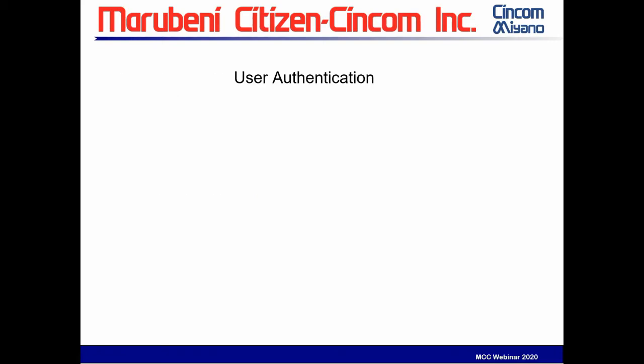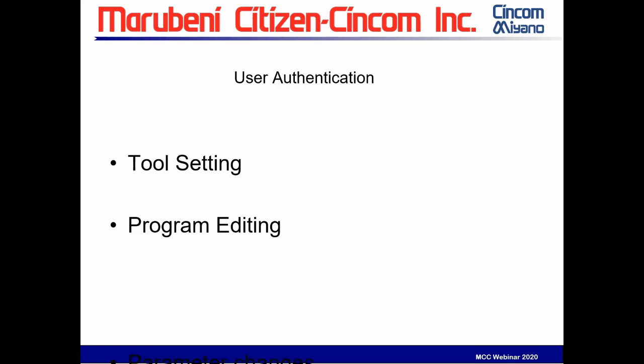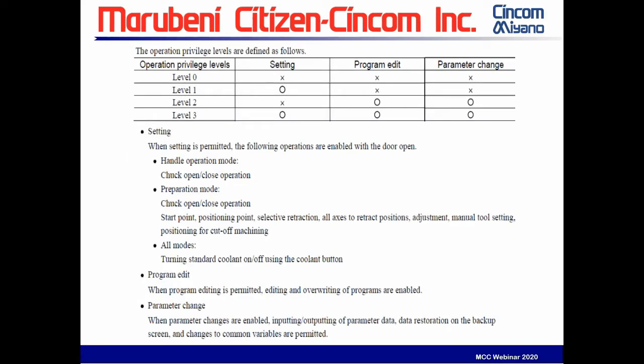Something else we've added to this is user authorization or user authentication. You can control who can set tools, who can edit programs, and who makes parameter changes. There's four levels. There's a zero level, which basically, if somebody has zero level privileges, all they can do is press the start button and possibly make an offset, but they can't do any tool setting, program editing, or parameter changes.